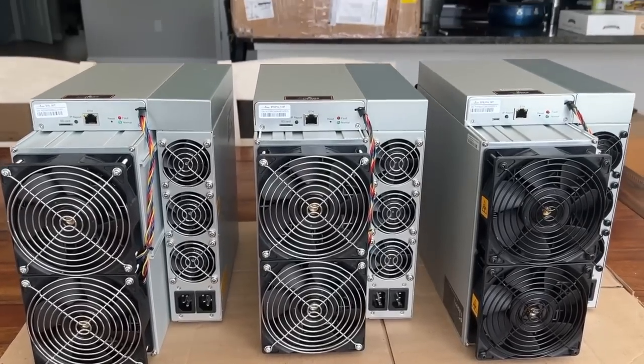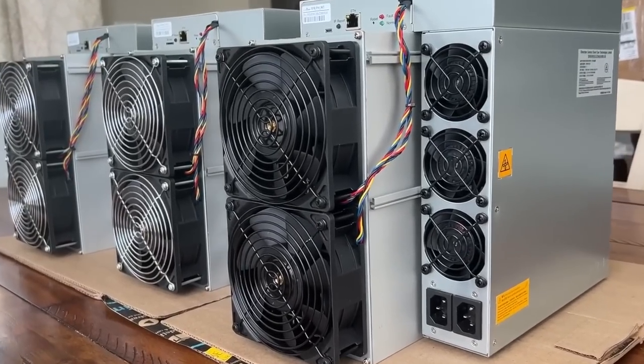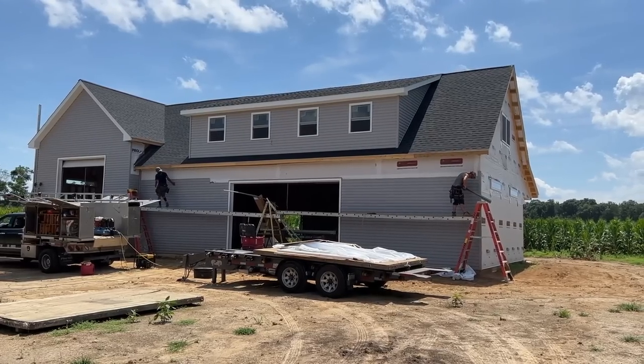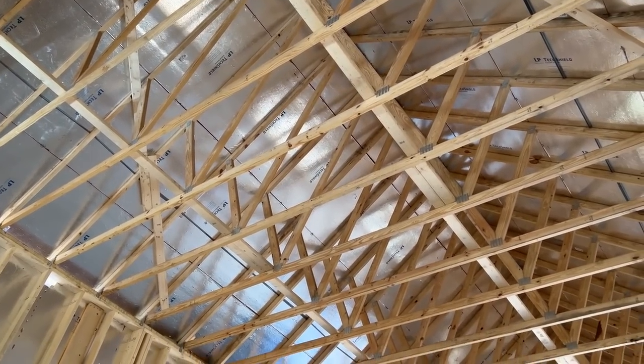When you start mining Bitcoin seriously, you're building toward an industrial-grade mining facility. The good news is getting three-phase is possible for me. The bad news is I don't already have it, and build-outs like this cost money. We haven't run all the numbers yet — the electric company will look at how much revenue they'll make off me, then decrease my bill accordingly. I'm worried it's going to be a six-figure bill. Right now I'm pulling single phase just to get up and running — running two legs in tandem for 240 volt.